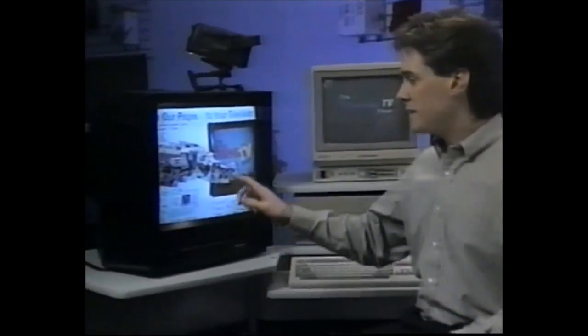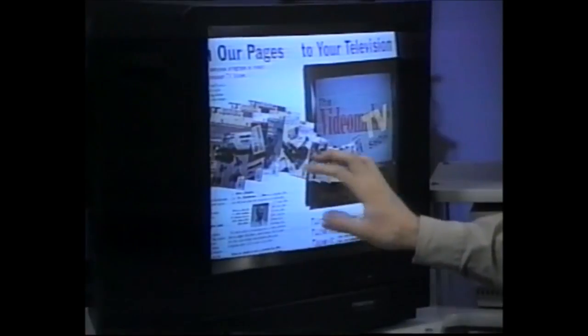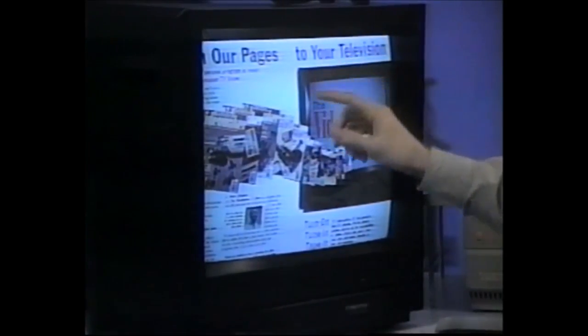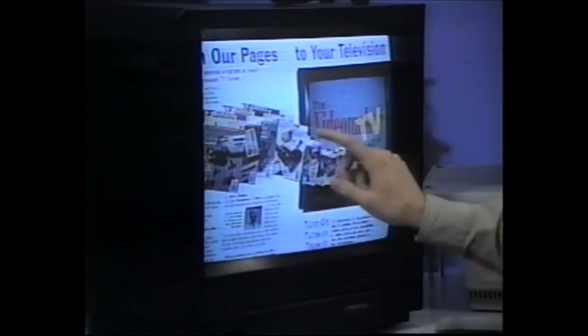Mixing video signals and computer graphics is not as easy as, say, mixing audio signals. Whereas any two audio sources to be combined can simply be placed on the same wire, video sources first require perfect synchronization. In other words, if one video source is conveying visual information from the middle of the screen or is instructing the electron beam to return invisibly to the top, any other video source to be combined with it must be at the exact same spot.